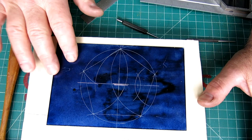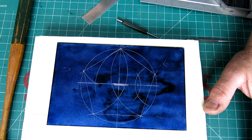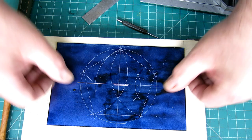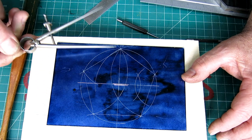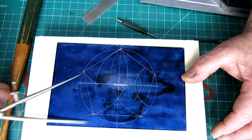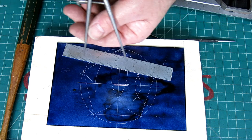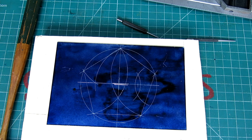So anyway, that's one method for doing what I would call a graphical layout of a pentagonal bolt circle. The other way is by using a table of constants that you multiply the diameter of the bolt circle by a constant, and what it gives you is these, which are called chords. This is a chord. That's another chord. So it gives you the chordal length when you use the constant method, right? So that's the chordal length right there, which in this case is, let's see what we got here. I don't know. Two and 5/16, something like that, a little more than 2 5/16.